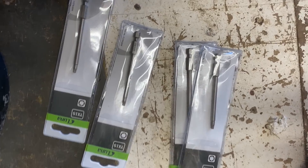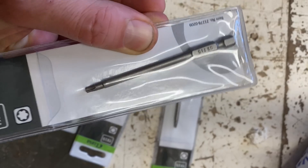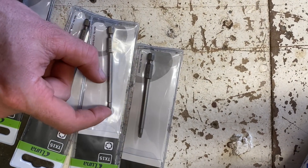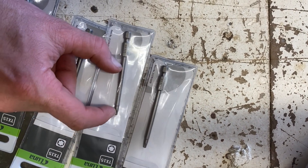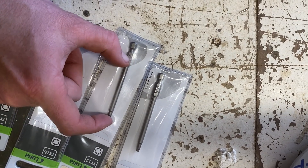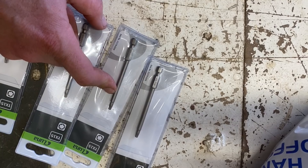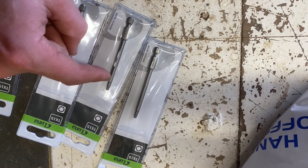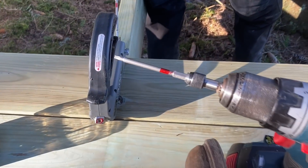Okay, we've been out for lunch and we found longer bits. Downside of these is they're too long, so we're just going to have to either mark them or find something we can weld on or stick on to make our own stoppers — if we just screw all the way down that will go right through the board. But it's a big difference from what we had because it will stop the tool jamming and it will also mean we don't have to go back and screw the screws in.